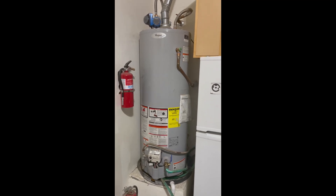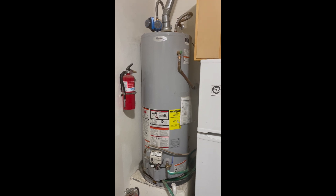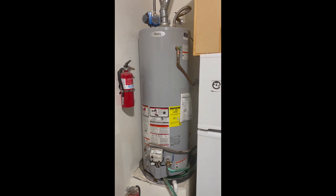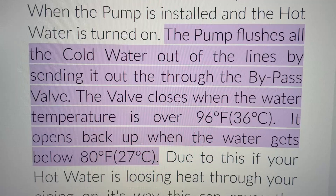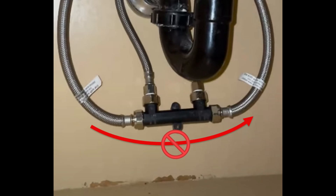I'm making a quick update video because there have been a lot of comments asking what the pump does when the valve under the sink of this Watts hot water system closes. The Watts website says that the valve closes when it's 96 degrees and it doesn't open again until 80 degrees, so there's a 16-degree window when the valve should remain closed. Anytime the temperature rises above 96, the valve closes and the water stops flowing.